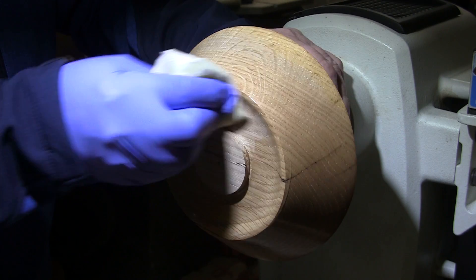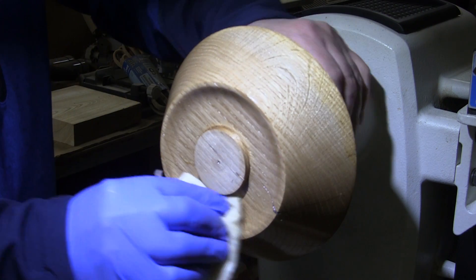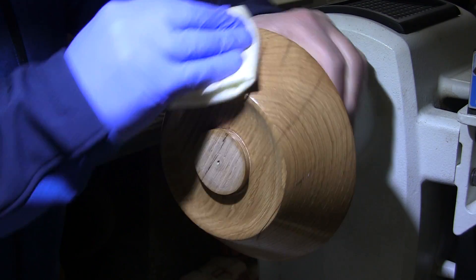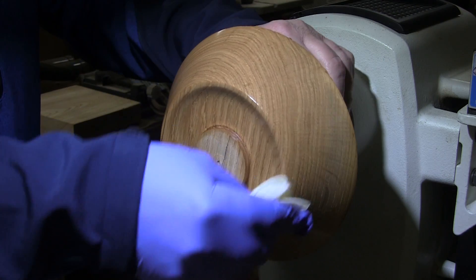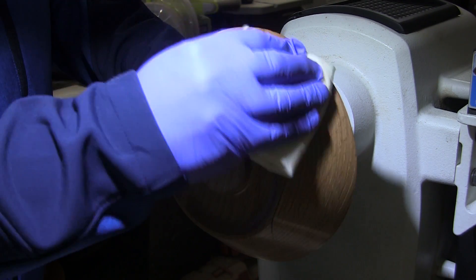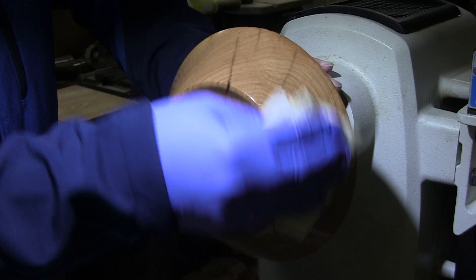With the natural edge stuff that I usually turn, no way can you turn this fast. I had it up to 1500 there for a few minutes — that was pretty cool. You get a lot smoother cut and it just goes quickly. Typically when I'm doing a natural edge or live edge bowl, you're looking at maybe a thousand RPM tops, often 500 to 600 RPM because it's out of balance. So this is like playing games here. This is fun — it's like playing with toys.